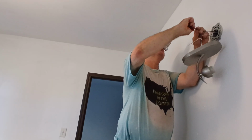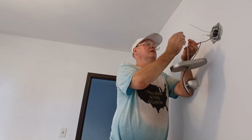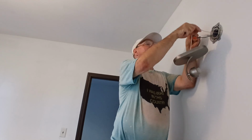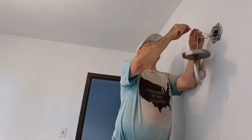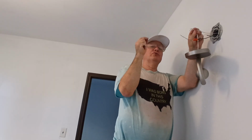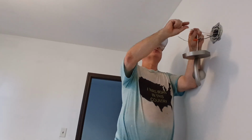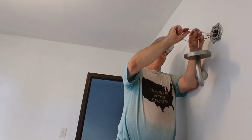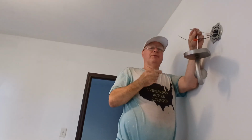Make sure it goes on nice and tight like that. And we'll take our white wire, get our insulation even at the top like this here. Bring our strands down. I don't twist the strands together so they wrap around the solid wire nicely. So we'll wrap them around our solid wire like this. Copper even at the end, our insulation is even at the bottom.